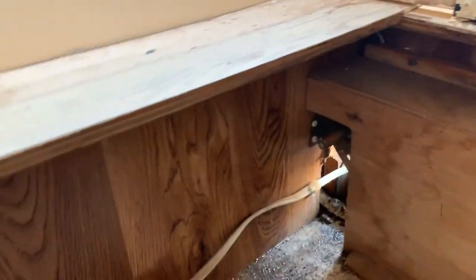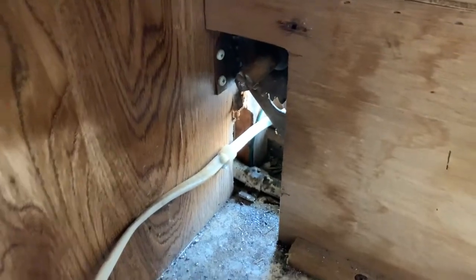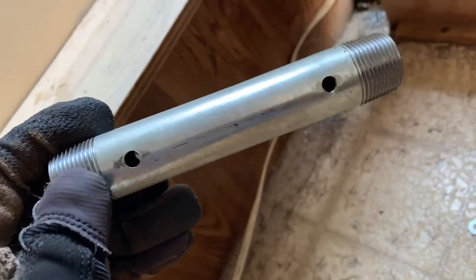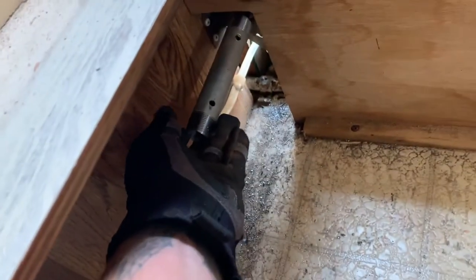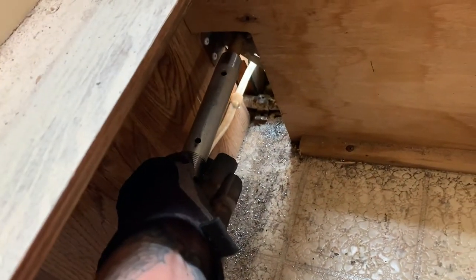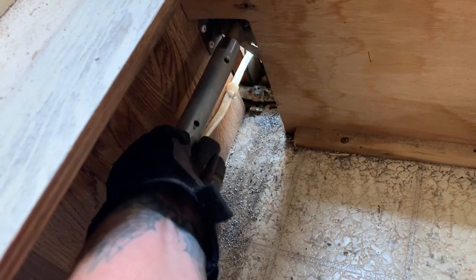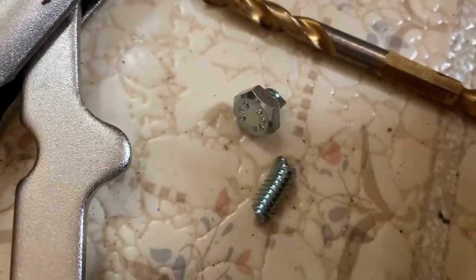I'm attempting something new - I had a little bit of success. So yesterday I discovered that the drive shaft - I'm just continuing to call it the drive shaft - had completely snapped in half. I got this piece of conduit, probably not the best option but it was strong, so I drilled some holes in it and connected it to the tubes on either side. The problem was there was so much torque - it did lift the back end, but the torque literally snapped this bolt in half, which is kind of scary.